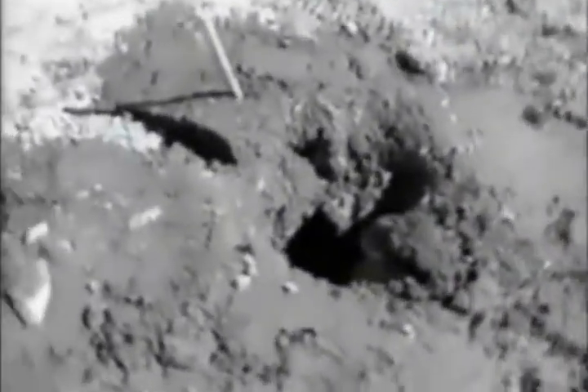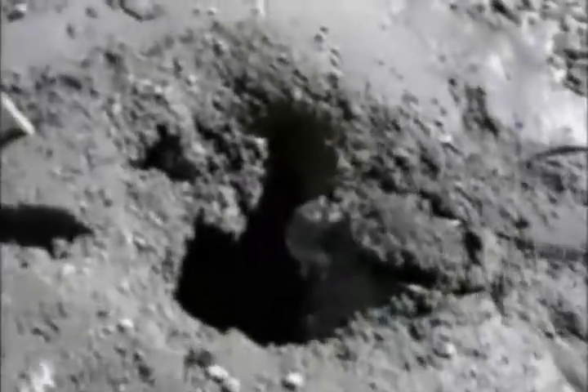You can see that's a nice, neat gun barrel borehole. The material is bound and bonded together on top — as this dries, it's going to set up and be real stable. Another hole: you can see there is a totally different look to the cuttings in the stemming pile. There's a row of holes here that were collared in quickly and easily, drilled to depth.